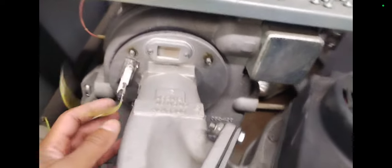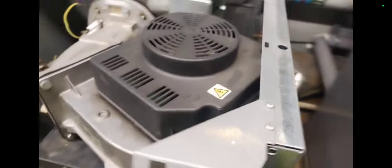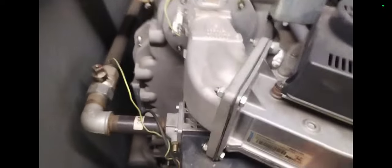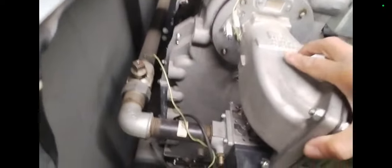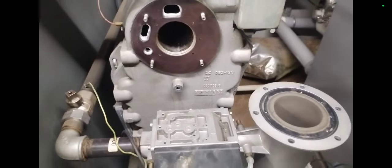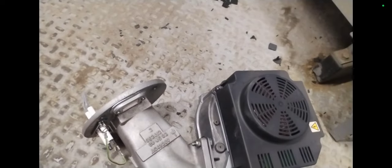Back at work, I had a situation where I had three boilers not operating. I was told that the boilers were finished, that there was no chance. I had fault codes coming up — all sorts of fault codes. One of them was stating I had a problem with ignition, or a blockage or some problem with the air pressure switch. So I pulled the unit out and inspected it.